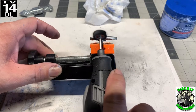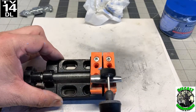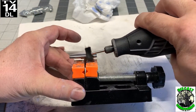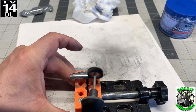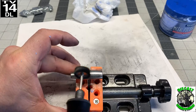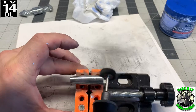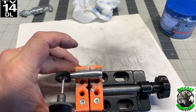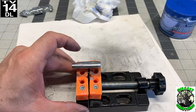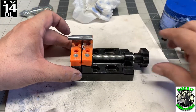As I was cleaning this rocket motor up I noticed that there were a lot of small scratches and pits in there — it was nice and shiny but it just didn't look good enough. So I went ahead and sanded it down with fine sandpaper: started with 400, went to 600, 800, 1200, and finally ended up with about 3000. Polished it up again and it looked like a mirror. If you do that with your body, base, or any other parts, start with a sandpaper grit that's not going to leave too deep scratches and then move up through the different sizes. I hate sanding if I don't have to, but sometimes it is necessary.